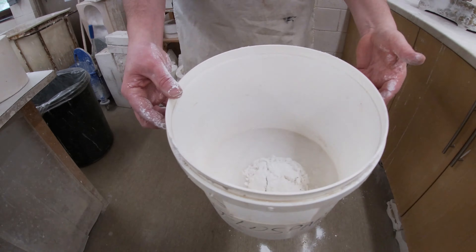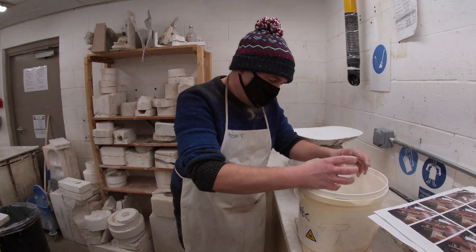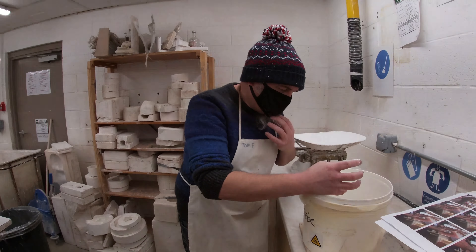We've got the plaster in there — you can see it's crowning out of the top. What we're going to do now is just leave it. By leaving it, we're letting every single particle of plaster start absorbing some water. Technically this is known as slaking. I could mix it straight away, but that would automatically start the chemical setting process. We want it to happen naturally — leaving it sit for a couple of minutes and letting the water absorb into all those particles makes for a much better mix of plaster.